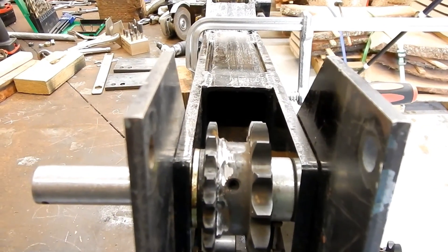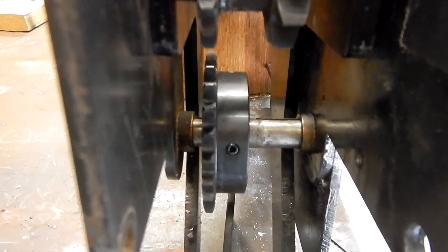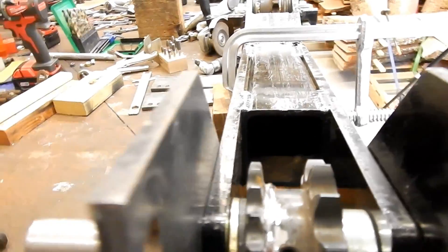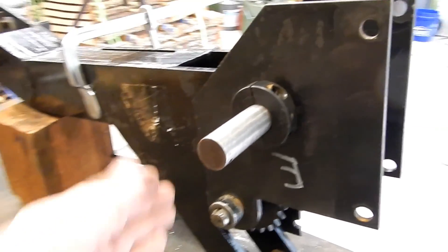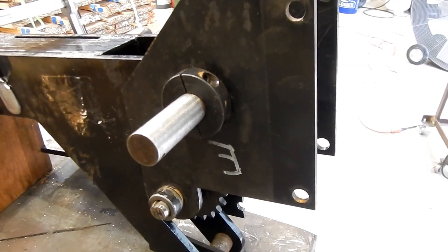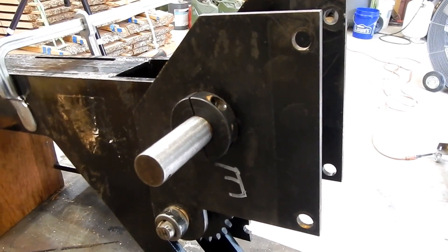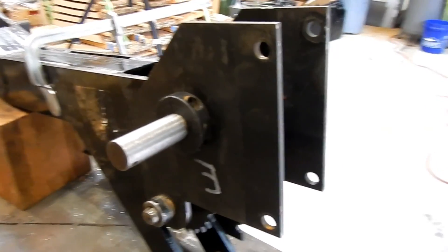You can see the difference in the drive gear — there's the bottom one coming off the three-quarter shaft. That's a 23-tooth sprocket on the bottom and a 22-tooth sprocket up top. On the back side up against the bunk, right here is probably where I'll add a support plate — a piece of three-eighths plate going out toward the bunk, bolting onto the bunk with a corresponding plate welded there. That should give added support from heavy logs, because being three inches further out, the more cantilever you have, the more stress you're putting on the frame.